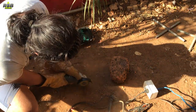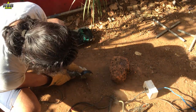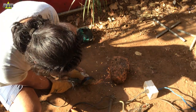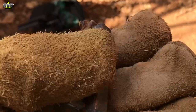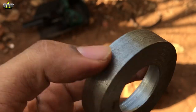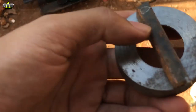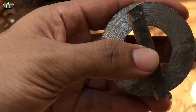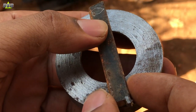The cup I had made on the lathe machine — I will fit it on the pole now. I wanted a rod to weld on the cup, so I quickly prepared two rods since I am preparing two tables. I will weld that rod on my cup. On this cup I will put the rod from behind and weld it. I'm doing it like this because in the future if I want to remove the bearing, I will have space to tap the bearing from underneath.